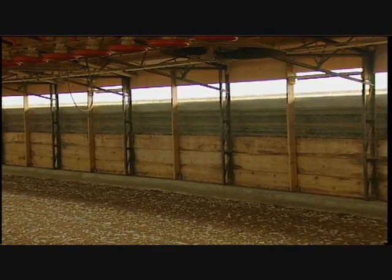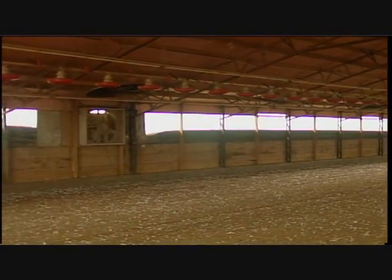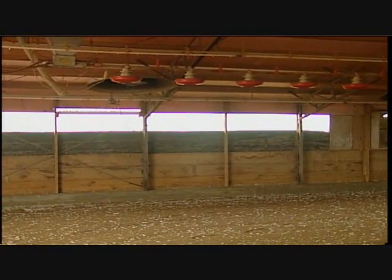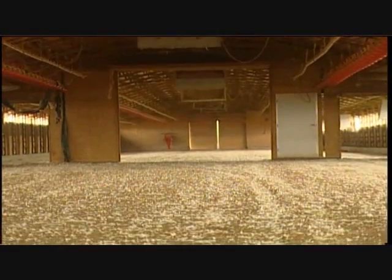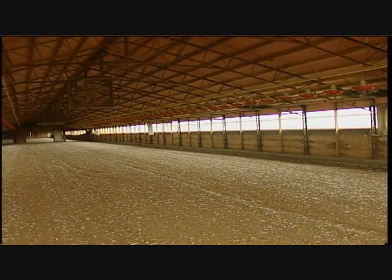If the side wind is at an angle, then flame into the angle. If the wind blows in, as in a gust, from the back of the machine, it can force the flame out of the front of the machine and change the direction of convection. It's important to have a breeze, as the torches need the oxygen and it helps keep the ceiling temperature down. The curtains should be in the down position.